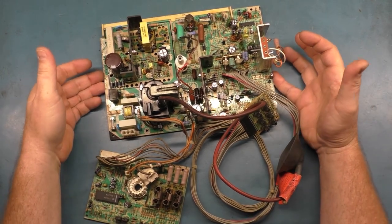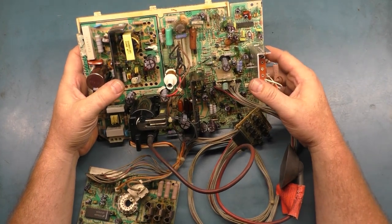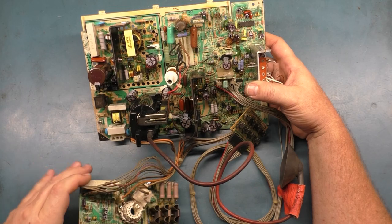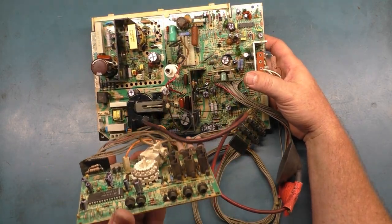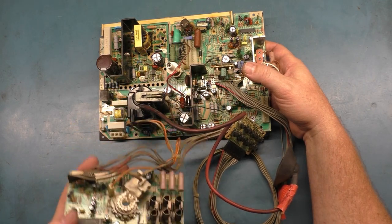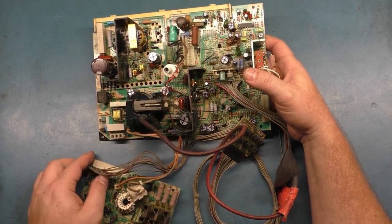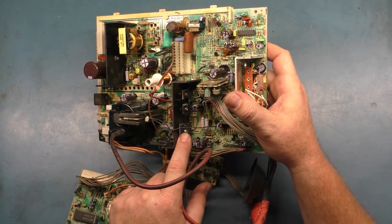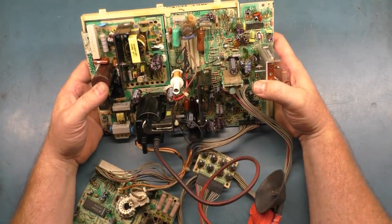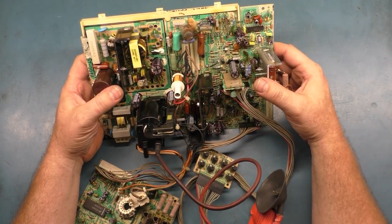Okay, and just like that, it has been 24 hours. More like closer to 25 hours, but we got the full new cap kit installed, the full reflow, we got the neck board completely fixed up, all of the transistors reworked and the solder redone on the back, and everything's nice and secure now and lined up. We got the new HOT installed, the FJL6920. We got the new resistor installed there by the B plus pot. Cap kit and reflow, and everything is now ready to go.